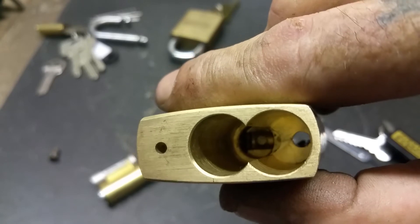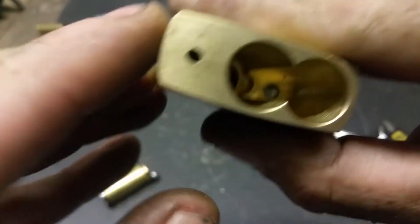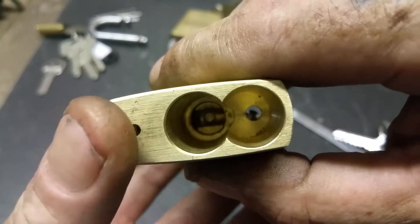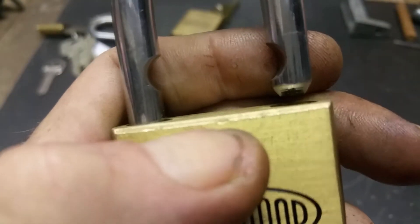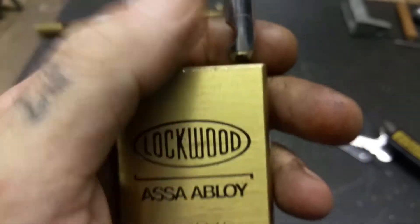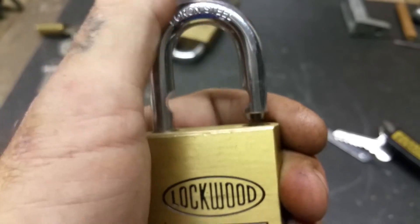If you prepare to drill a hole, you can do it - just find out where that pin lies in relation to the front, drill a hole of the same diameter as the pin, and punch the pin out. When you take yours apart, take the little insert out, drop the ball, take the shackle out, put the new shackle back, put the ball back and reinsert the pin. But you're going to end up with a tiny hole on the face of the lock - it's up to you. Another option is to just get one with a standard shackle.